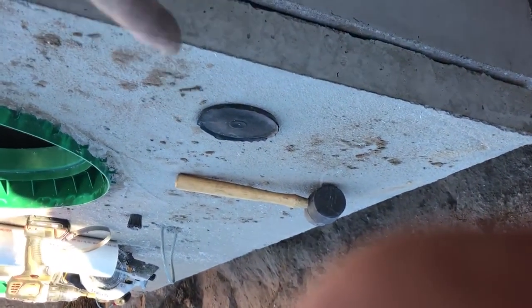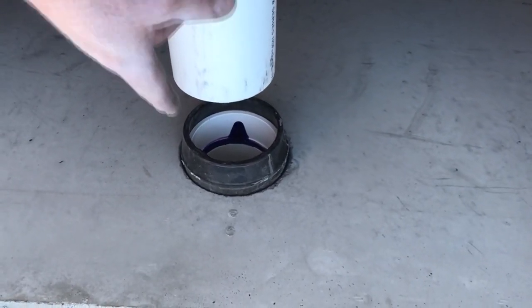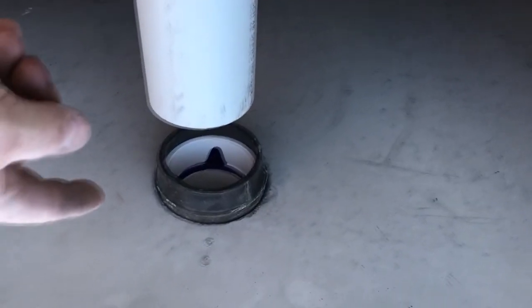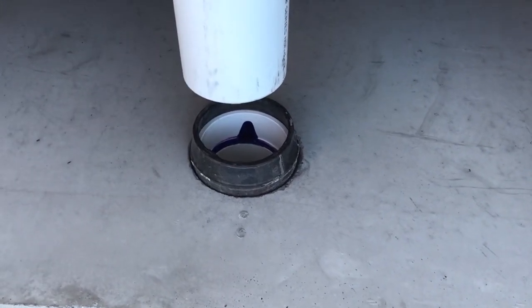Here's that seal on the other end — I cut off the end of it with just a little knife; it comes off pretty easily. And that's the end of that filter. We're on the effluent end now, the outlet, down to the leach field. Here's where we begin to move this down the hill to the leach field, so we'll put some glue in there and get this set.